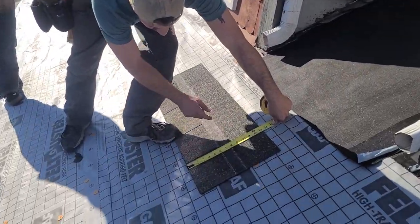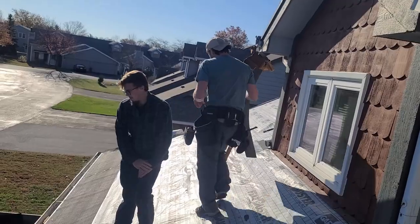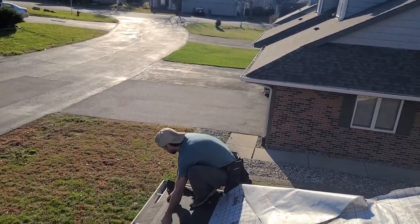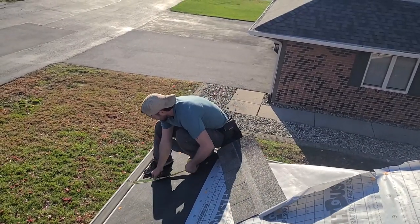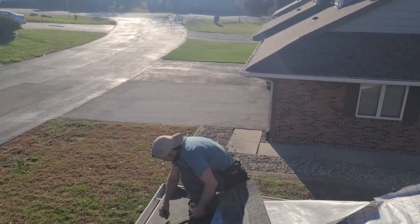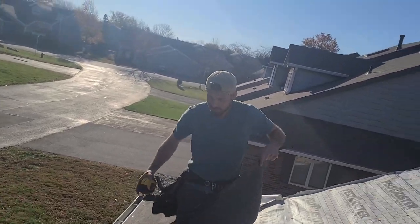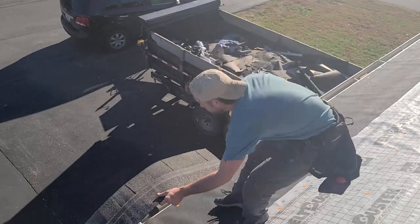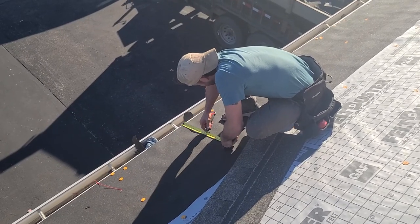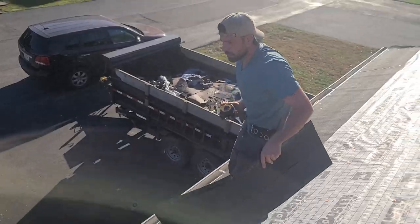You're going to want to know your shingle. We've got a five and five-eighths exposure on a shingle that's 13 and a quarter inches long. What we're going to do is come down an inch for our starter, right where our shingle goes. So we're going to pull up and subtract an inch — it was 13 and a quarter, so I'm going to mark 12 and a quarter, maybe 12 and three-eighths. We'll snap that and have an easy line to pull from.